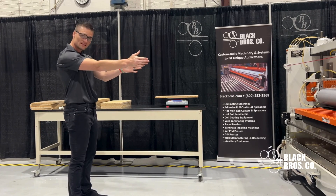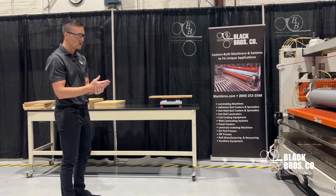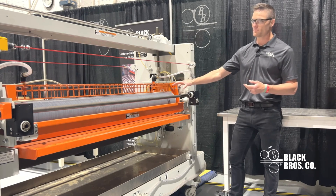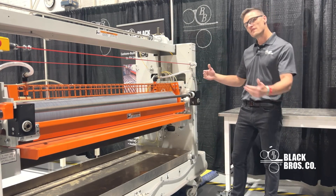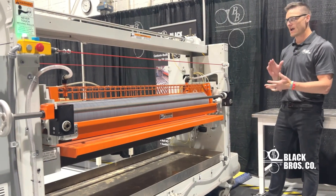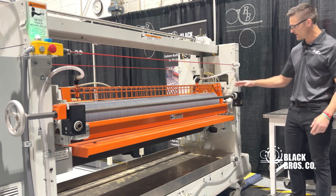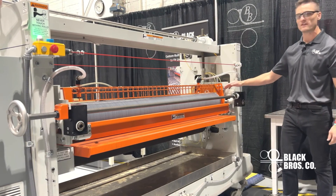I need to open this side of my doctor roll to reach 10 grams per square foot — perfectly normal on the equipment. Now we're on the infeed side of the equipment, where I'll make the adjustment to this upper doctor roll. There's a single hand wheel adjustment here that moves the whole doctor roll in and out in unison. Since the right side is putting on the accurate weight and the left side is putting on a low weight, I'm going to break a coupling so I can make adjustments to either end of that doctor roll without affecting the other side.